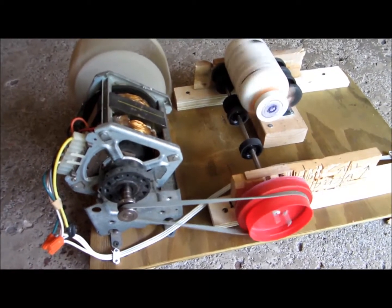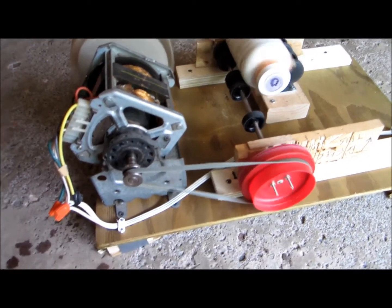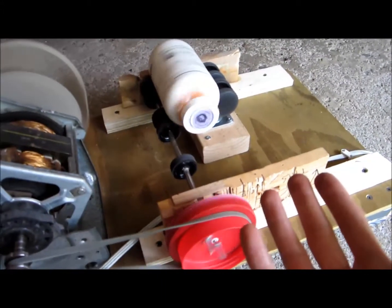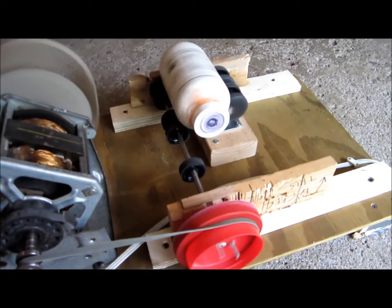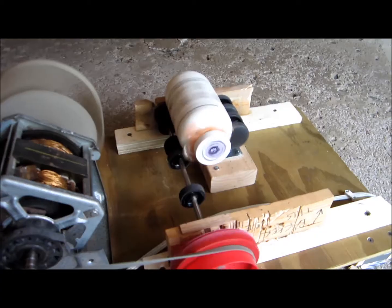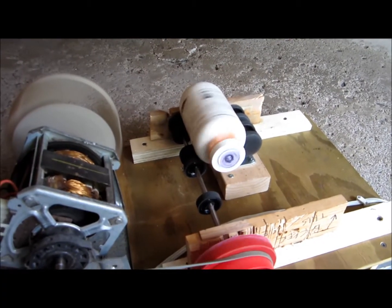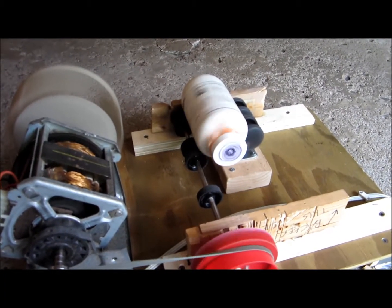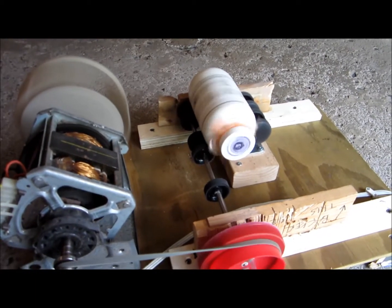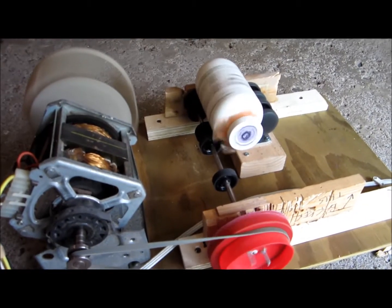This is in my garage so I don't really hear too much of the noise inside. As you can see the shaft drives the ball mill jar and it's spinning at maybe 80 RPMs, which seems to be about right for the number of balls. If you go too fast you'll centrifuge your balls and they'll stick to the sides; if you go too slow they'll just roll around on the bottom.